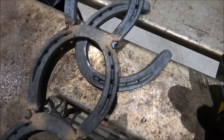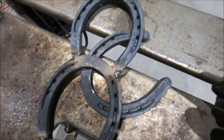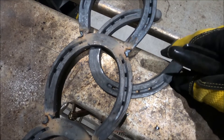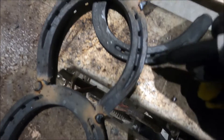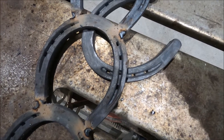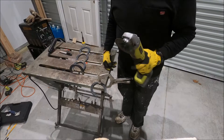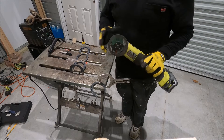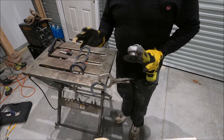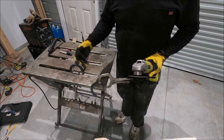For the arms for the snowman, what I do is just put one of the horseshoes underneath it, kind of get the arm to where I want it, and then put a mark on here where you want to cut it. Cut one side, then do the other side. I'm going to use my Ryobi grinder to cut this off — I have a grinding wheel in here. Not a sponsor, just like their tools. You can also cut this with a hacksaw.